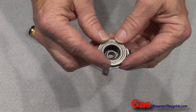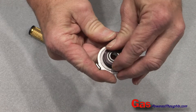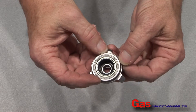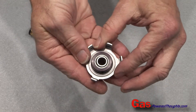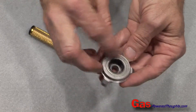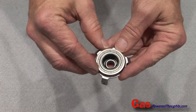They're here to tighten the outer ring of the bearing. Over time, this bearing will get some play in it, and the inside of the swash plate will actually have some play in it. By tightening these set screws, you can actually deform the outer ring of the bearing slightly and take this play out. This swash plate will last a very long time. Put these three in with blue thread lock and just snug them up against the bearing at this point.